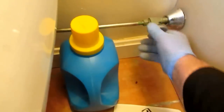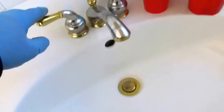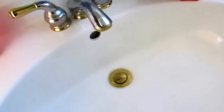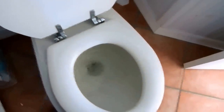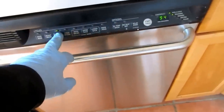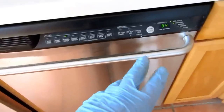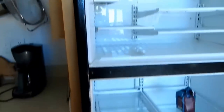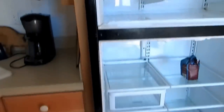I'll pump the toilets out a little bit. I must have a problem with the valve — I'm shutting it off here. I got the compressor set at 60 pounds outside, so it's gonna keep pumping that air 60 pounds through the system. I'll put all the water out. I gotta pump all these toilets down with my little pump. I'll start the dishwasher up on a cycle — normal wash — I'm gonna push all the water through the solenoid. The air's gonna push all the water, then I'll dump antifreeze in after. This is an ice maker in the refrigerator — I'll pull that out and disconnect that, I'll show you what I do with that — that will freeze if you don't do it right.